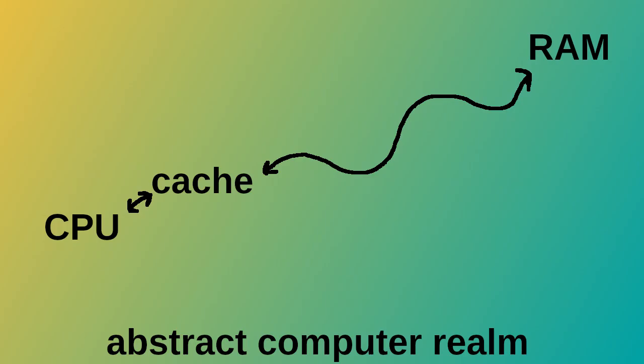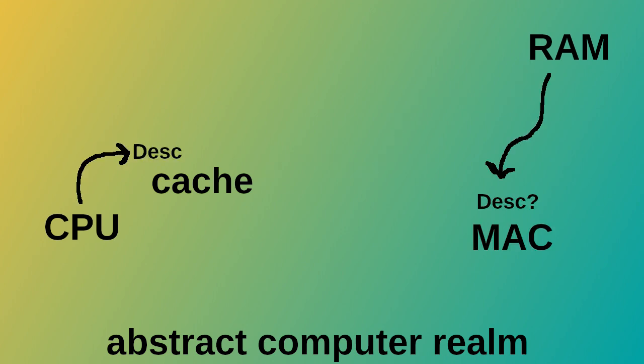The other thing that was added to CPUs to increase performance was cache. This is a small amount of memory on the CPU. This allows the CPU to fetch some bit of data and do several operations to it, all without needing to send it back and read it back from memory on every operation. Where this becomes an issue with writing drivers is that for my writes to set the registers to take effect on the hardware, they need to go all the way out to the memory mapped address of the device. The other issue is that if the device itself also needs to access buffers in the RAM, or those descriptors used by the Ethernet device, they also need to go all the way out to RAM. So what can happen is that the Ethernet driver can write something to the descriptor, but that change might not make it back to RAM by the time the Mac device itself goes and reads that descriptor from the RAM.